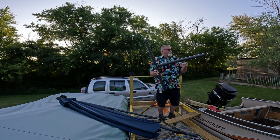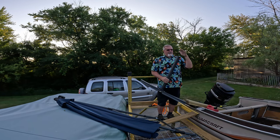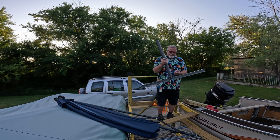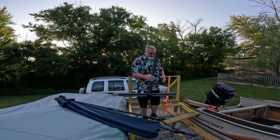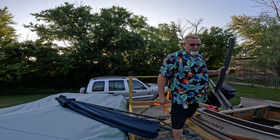So I think the first order of business, I want to reuse this tube because it does have this bushing on top, but I don't like the notch in it, which is fine. I'm gonna saw this off so I can basically attach it straight to this pole with pipe clamps or something like that to hold it vertical and sturdy. So let's go get in the bandsaw and get busy with that.